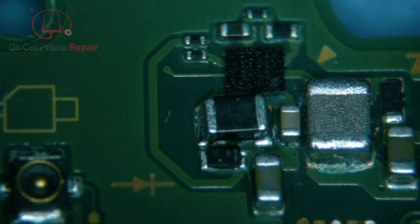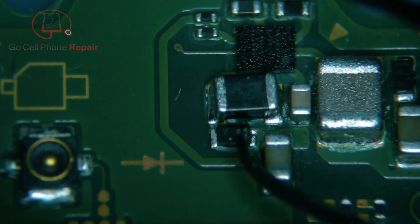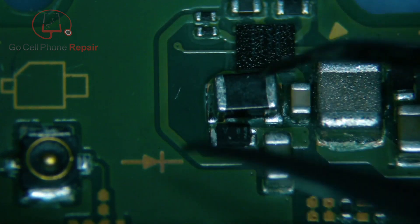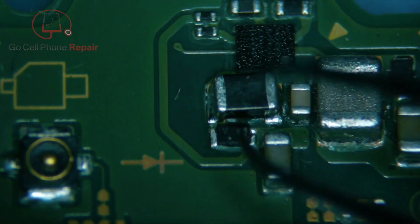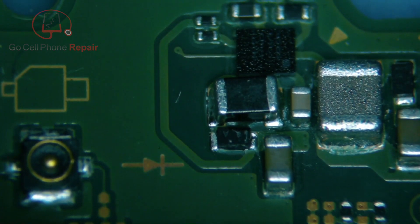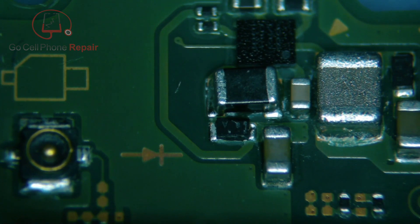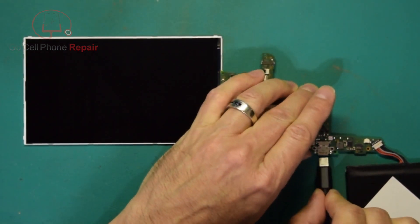I was about to give up on this, and I did some probing. Turns out that this diode right here was bad, so I went ahead and replaced it. You can see I kind of got this filter a little off-center, but it's still all connected. So hopefully this had something to do with the lack of image. If not, it's just about time to call this a wrap. All right, let's try this again - got the battery hooked up, screen, backlight, and I hope we get an image this time.